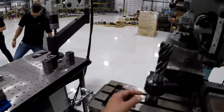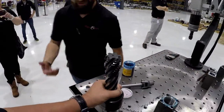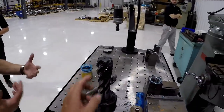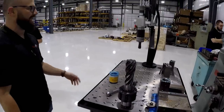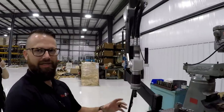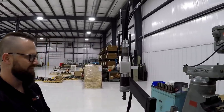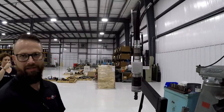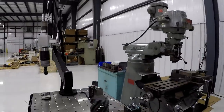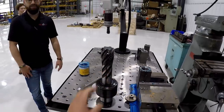So, is this the 2-inch tap here? That is the 2-inch tap that the unit that you have, that GHM60, is gonna push. That's always a big question that we get, what does the M indicate? It's actually multi-position. So this unit has the capability of going 90 degree, full horizontal, 180, and then hitting a 45, a 33 and a half, you name it, you'll be able to knock it out all the way across the board. That's gonna be great having this capability if we ever need it, having that 2-inch tap capability. Yeah, it's gonna be pretty awesome.